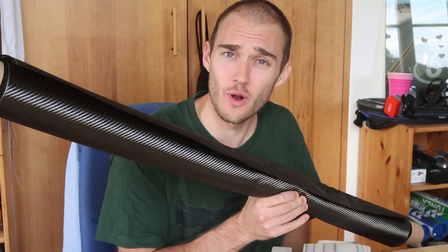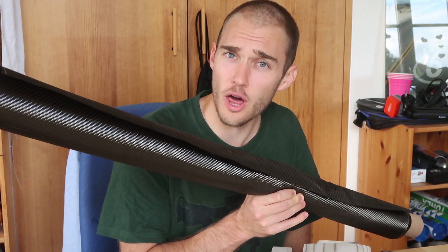I've got two types of carbon fiber. Both are of industrial type, so not so expensive. I've got a 240 grams per square meter cloth and a 160 grams per square meter cloth. I also bought some vacuum bag and some vacuum ply — that's a combination of peel ply, perforated film, and bleeder. Why is it called bleeder? Because the laminated piece can bleed into it if there is excess resin, so you get the right ratio between resin and fibers. That's the goal.